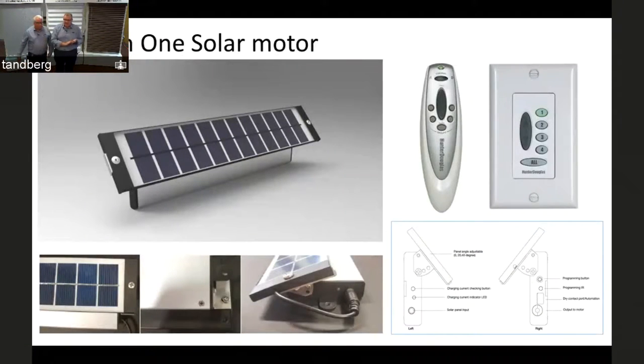There's also a wireless wall switch option. The Photon 1 motor features a fabric tensioning function, similar to the Loggia motor — useful for lock-down awnings with lock bolts or straps. It supports up to 15 square metres for EVO with an unweighted bottom rail, or up to 11 square metres with a weighted bottom rail. The Photon motor is also now available for System 2000 pivot arm and System 2000 straight drop.